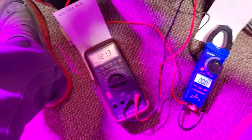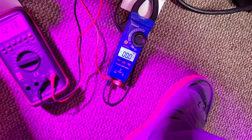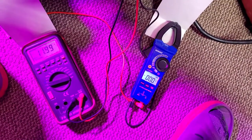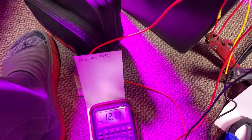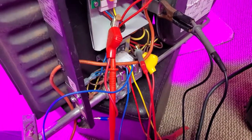That's the safety circuit. Look — that's got 12 volts and this has got zero. Got 11.99. And we're still seeing it, seeing the red wire. That's the third time — it's going to do a lockout.